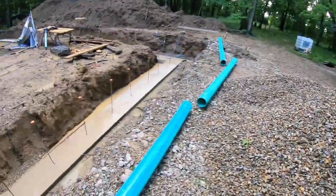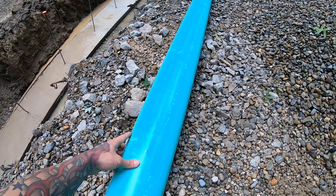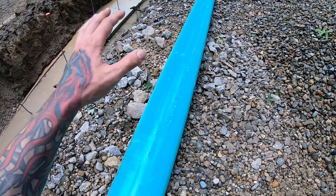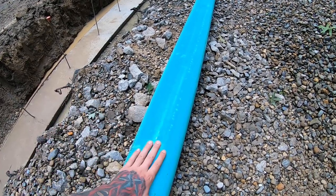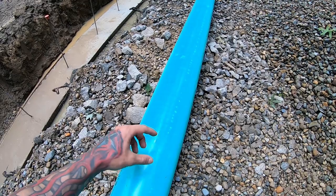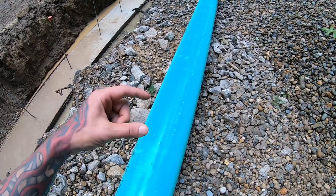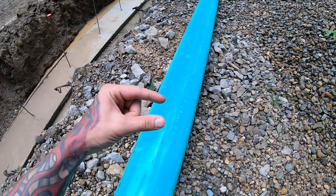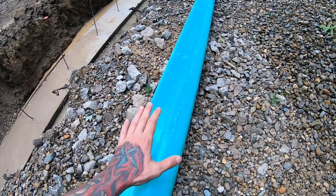The super big problem you never want is the corrugated pipe with the filter sock already around it. If that sock is on a four-inch corrugated pipe, it only sticks out an inch or two away from the pipe. If you've got a bunch of silt and clay and dirt go down and eventually clog that sock, your drain is no longer going to work. If you take a piece of that fabric only an inch wide on a four-inch piece of pipe, and it sticks out two inches on each side, you've got roughly eight inches all the way around giving you protection against keeping silt out of that pipe. Once you clog that filter sock, you're done.